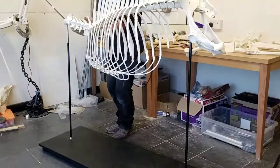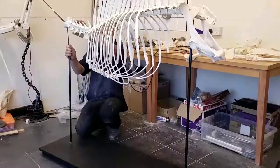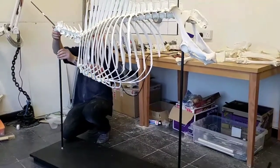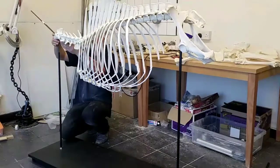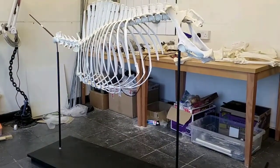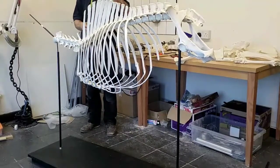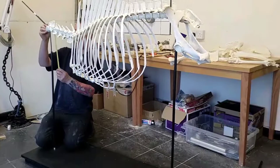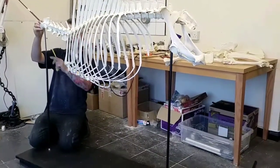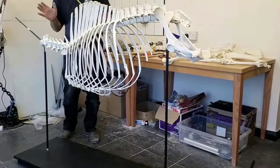Then I can measure how much higher I am at the front. Basically I want the neckline to be in line with the pelvis, so this front bar needs to be a little bit longer. I'm just going to grab my tape measure. The front bar — I'm happy at that length. I'm measuring 7 inches longer than the temporary support. So now I shall go cut another bar 7 inches longer, and then that will be the finished height of the skeleton.